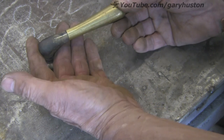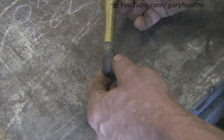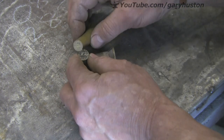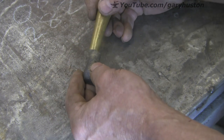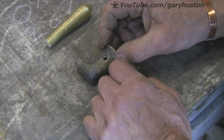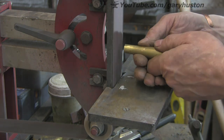Now I've sort of worked out where it's supposed to go. I've put a line there, a registry line, but it's not a very good fit. So what I'm going to try and do is grind these flat both ends so it doesn't matter where they go, and then I'm going to drill and tap both ends, put an HT stud in, screw it together and then braze it. That's the theory. So let's have a go.